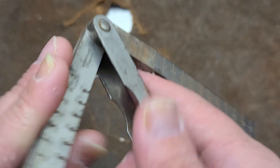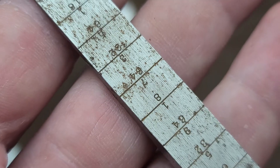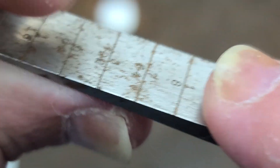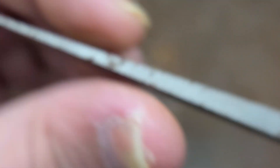And of course, the last thing is this taper gauge, which is pretty interesting. It goes by 1/64th of an inch. So if you press it into a slot and you're just trying to gauge it — if it goes up to this line, it would be 1/16th of an inch; if it goes up to this line, it's 3/32nds of an inch.